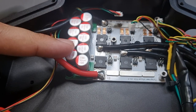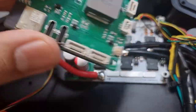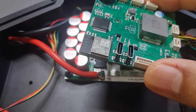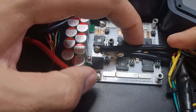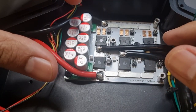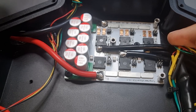The heat sink isn't just any heat sink — your whole box is your heat sink. That meant we had to make three PCBs instead of one: one metal PCB (more expensive because it's metal), a separate capacitor PCB because you can't solder capacitors on the power PCB, and a separate double-sided logic PCB. So instead of paying for one PCB we're paying for three, meaning our costs are significantly higher. The power PCB is mounted to the box with one, two, three standoffs plus six bolts on a very small surface area to ensure it's absolutely flush, providing optimal heat transfer so temperatures stay low and you can squeeze maximum power from your VESC.